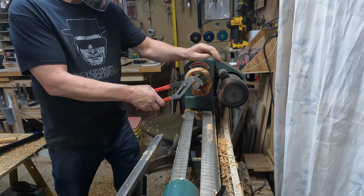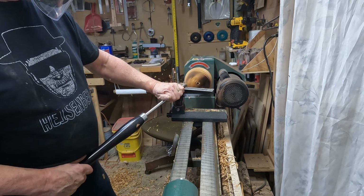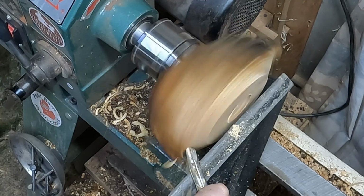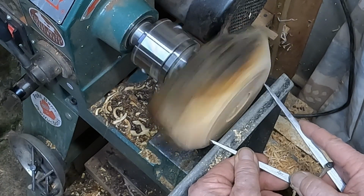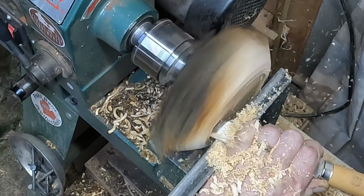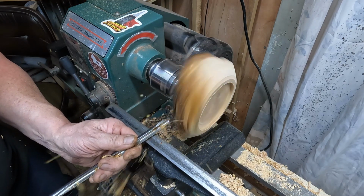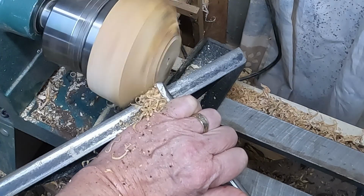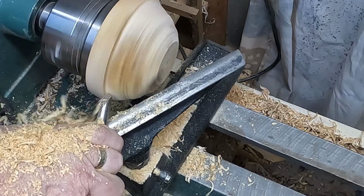At this point, I would be remiss were I not to give a shout out to my brother-in-law. He asked whether I was going to dowel the crosses and bases together, and I replied I would turn a tenon on each base to then insert into a hole yet to be made in the bottom of the crosses proper. This turned out to be a poor decision due to the orientation of the wood fibers. The grain fibers in a dowel are lengthwise. The grain fibers in a turned tenon, other than doing an end grain turning, are side to side and are substantially weaker. It was after the first oops of the project that I decided to use dowels. Thanks, bro. As there were 6 bases to make, each step in the process was done 6 times.